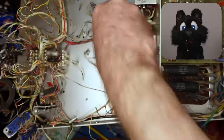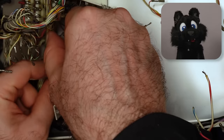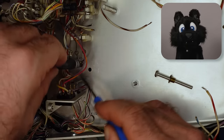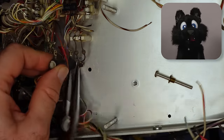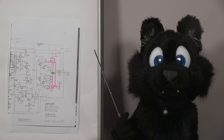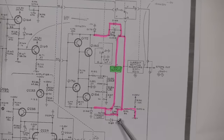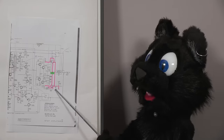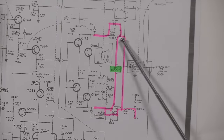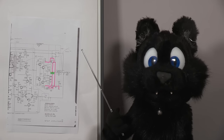Untangling the larger part of the wiring loom next. The wired components up front are part of the step generator amplifier supply, including two more electrolytics. These provide smoothing for the generated signal. But why two of them? One for each polarity. There's a diode in parallel with each, so the polarity switch, implemented with relay K1 or 2, will make one of them active and the other one is shorted out with the diode. I checked those and they are working fine.